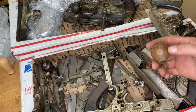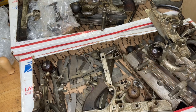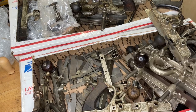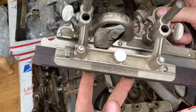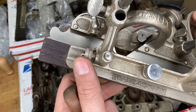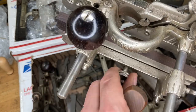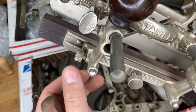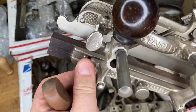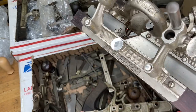Here is my personal user 45 — this did not come in these boxes. The main thing I want to show you is the set screw on the micro adjust fence. That's what it's supposed to look like. You loosen that little guy, make your final adjustment to get the fence exactly where you want it, and then tighten it down. That keeps your fence from migrating while you're actually using the plane. I'll cover that in a future video on how to use the 45.